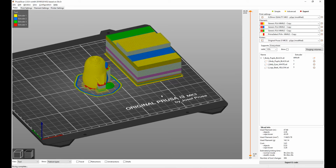And in my experience, the way P2PP handles pings makes it much more able to react to changes in the printer. And with a bit bigger purge block than you would get away with printing at lower speed without the buffer, it is always able to perform the transitions properly without any bleeding. And of course, since my primary usage is for soluble support, it's super important that it is not bleeding, because it's not just causing a visual artifact. It actually totally ruins the model, because you get soluble support into maybe a structural part of the object and it will just fall apart afterwards.